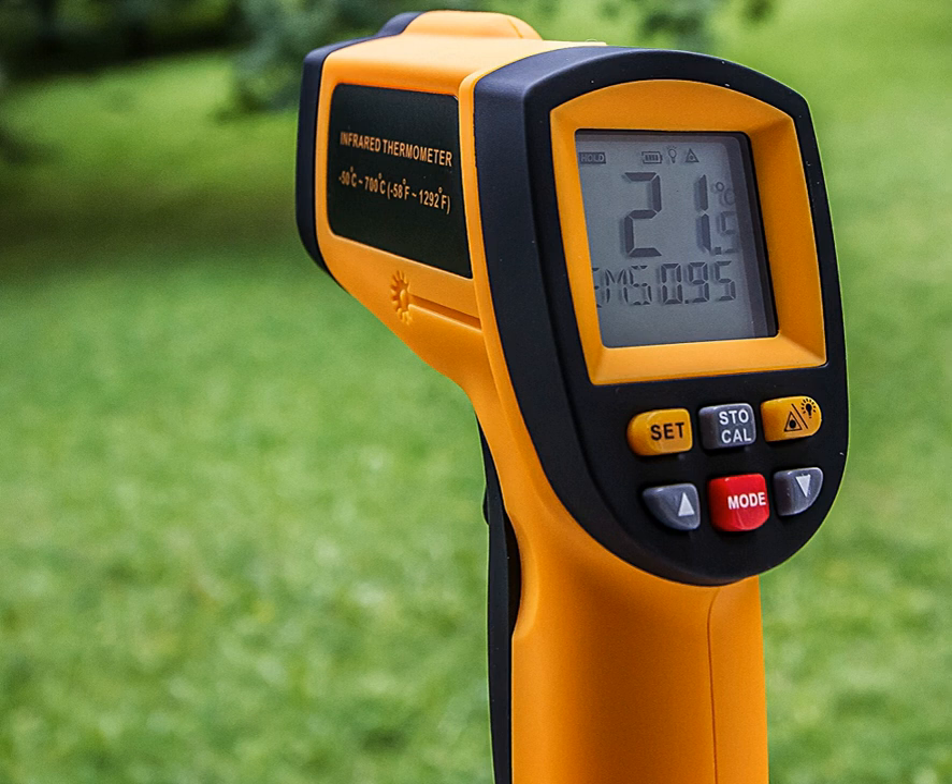The most common infrared thermometer is the spot infrared pyrometer, which measures the temperature at a spot on a surface — actually a relatively small area determined by the D:S ratio. These usually project a visible red dot onto the center of the area being measured that identifies the spot being measured, but plays no part in the measurement. The actual angular area being measured varies among instruments and is not restricted to the visible spot.